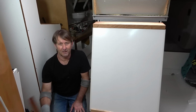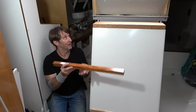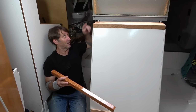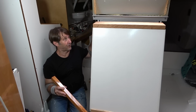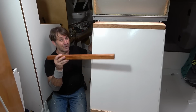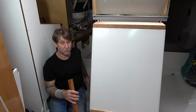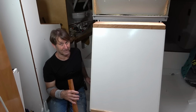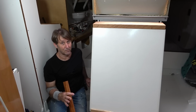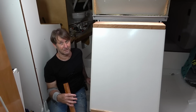But right now, I've got this one last piece of rosewood as a beam, which I'm going to fit, if you can imagine, about this position on the inside. And that'll mean that 3 of the corners of this box will be very, very securely epoxied together. And this last lower bottom corner, these will be held in place by pins that will also lock the box in place, stop it from moving, and also be securing those last bottom pieces together.